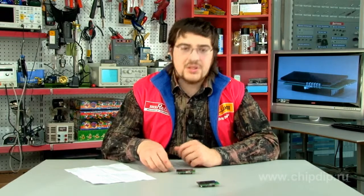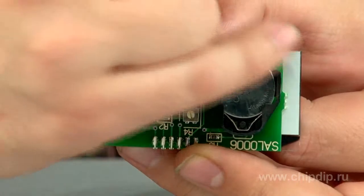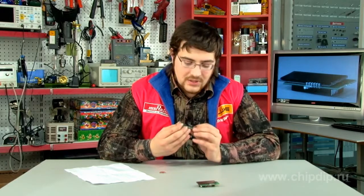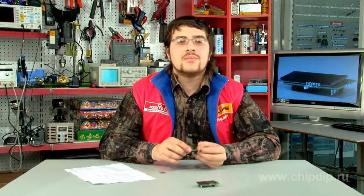The model uses an inbuilt lithium power cell of type CR2032, which lasts for about 20 days under continuous load. Any other direct current supply with a voltage of 3V can be used to power the device. When using an external power supply, connect the plus to the 3V contact and the minus to the 0V contact.